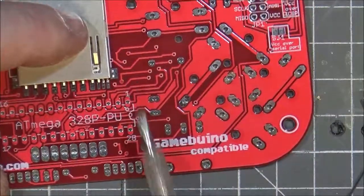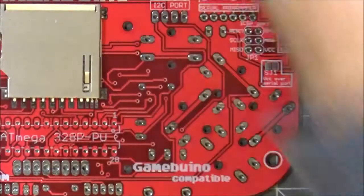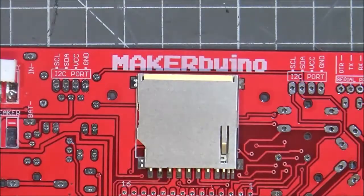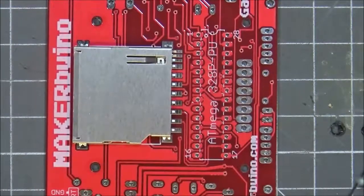I think it's all these connectors down here. I could do with using the heat gun, to be honest, and putting some liquid solder on there, but I'm not that confident with it yet. So we'll stick to the original plan. Let's get on with soldering these the old-fashioned way. Right, so that should be on. It should be hot. Not too hot, just over 300. Should do me. Then I want to continue by soldering the 4 pads of the socket shielding. Okay, so it's the corner bits here.